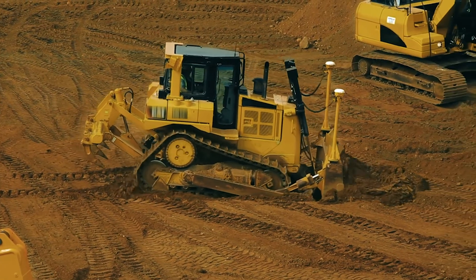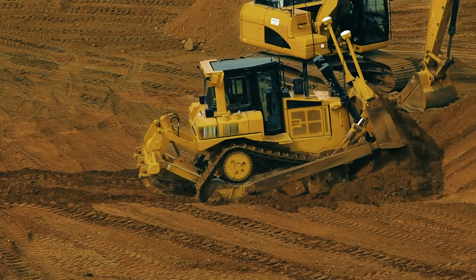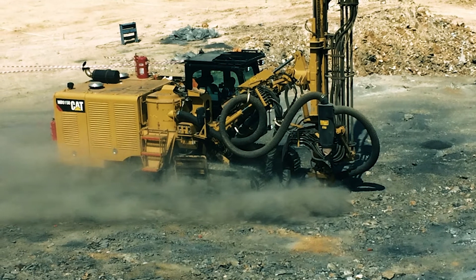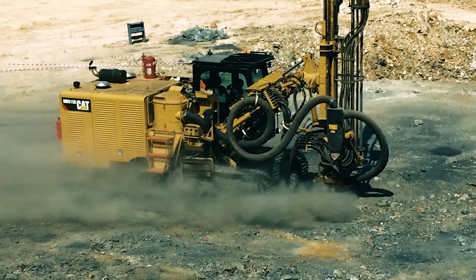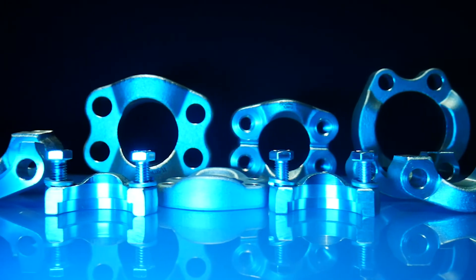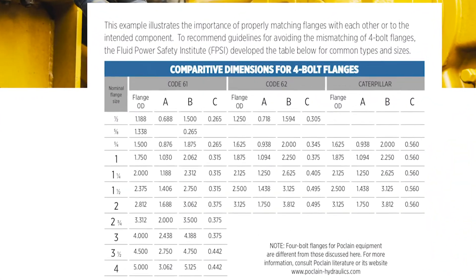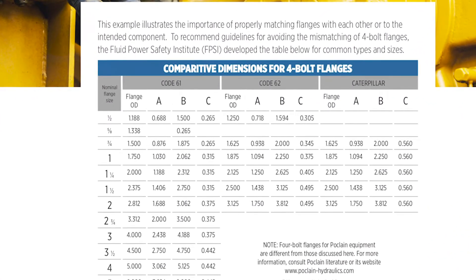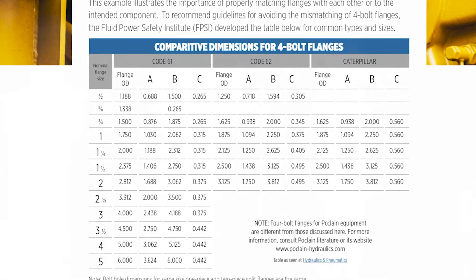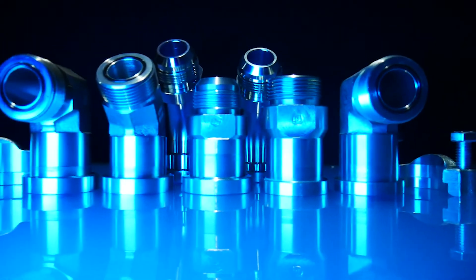There is also another style that must be accounted for and not interchanged with SAE flanges. This other 4-bolt flange often found in the field is called Caterpillar flange. This style is almost an exact match to the SAE Code 62 4-bolt flange, but there is variance in thickness on the flange heads, and for this reason, these connections should not be interchanged. Although many SAE 4-bolt hydraulic flanges might look alike, or different flanges and fittings might appear to be compatible, that is usually not the case. SAE Code 61, SAE Code 62, and Caterpillar 4-bolt flanges have dimensional variations and slight differences in configuration, plus the differences in allowable working pressure do not allow them to be used together or interchanged. Care needs to be taken to properly identify the right connection to create a safe and leak-resistant seal.